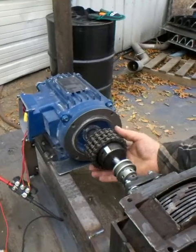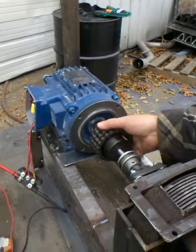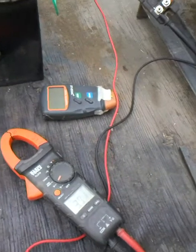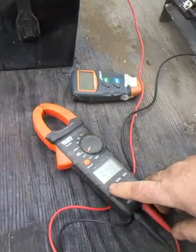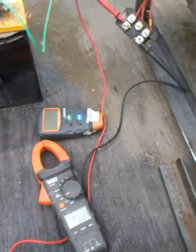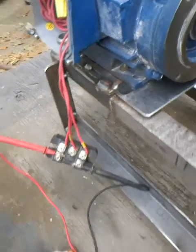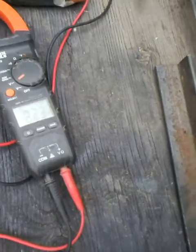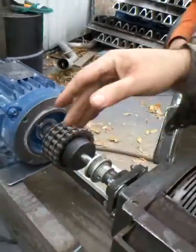Generator, which doesn't need self-ignition, self-starting. You can see right there — by hand I can rotate that and we're getting DC voltage, it's going through a rectifier bridge, and right there just by hand I can get 9, 10 volts just by spinning that.